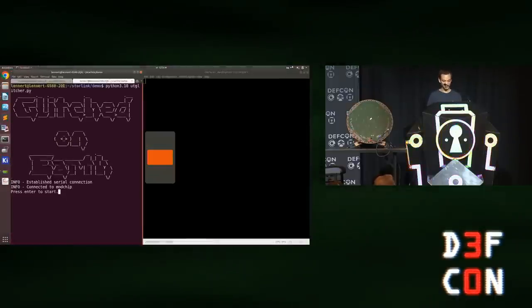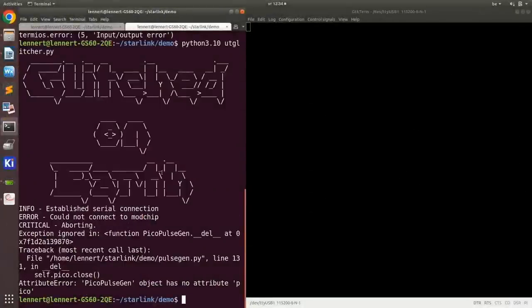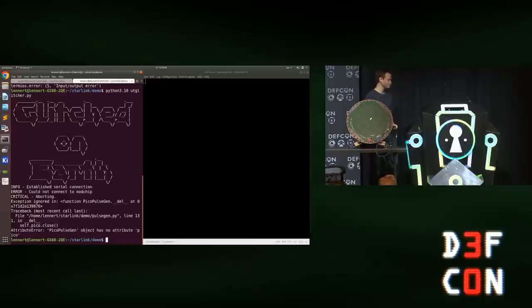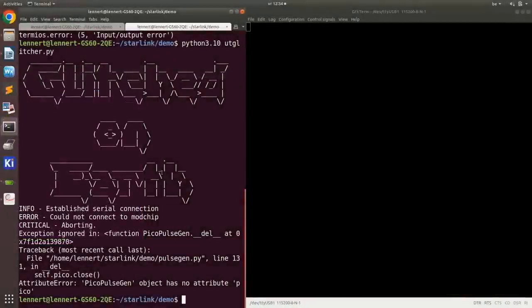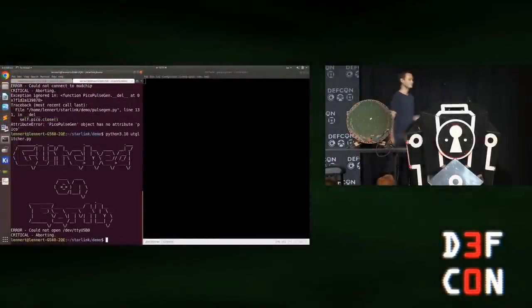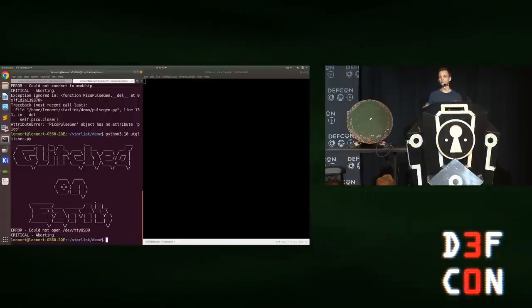There's a demo attempt, though it's tricky, especially if it crashes. In Q&A: the entire process from getting the user terminal to having the full attack working was about one year, though it wasn't the only project worked on in that time. Regarding eFuses: yes, all eFuses are now blown, so connecting to the UART connector on any current dish will show no output. Fixing this issue requires a new silicon revision of the SOC, which will probably take a while.